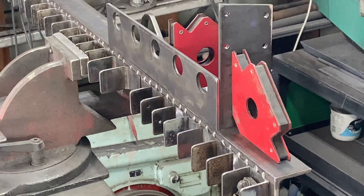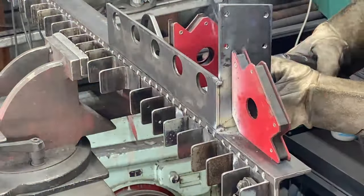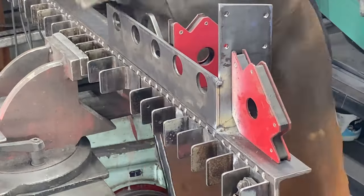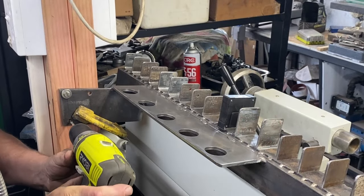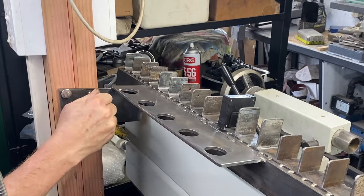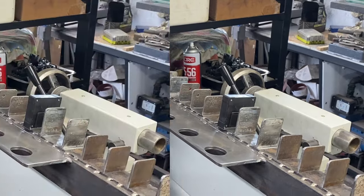This view will probably give you a better idea of how this is all going to work and how those two pieces are connected to the main tool holder. I tack everything in place, test it back on the machine, and then come back and fully weld it off camera. The next step is to mount it to the post at one end — I pre-drill some holes for the bolts and then screw those bolts in.